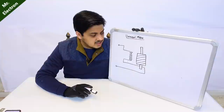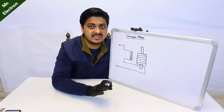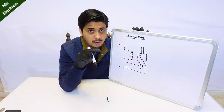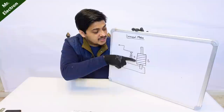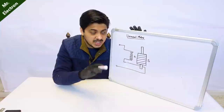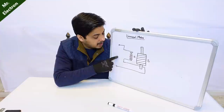That's the residual magnetism I was talking about. Because of previous operation, some residual magnetism is always left in motors, which is being utilized here. In this universal motor, this is the armature - let's assume that the motor was stopped at a point such that the poles stop with residual magnetism of north over here and south over here. Now when this rotor or armature is rotated at high RPM, that residual magnetism is going to induce EMF in the field winding, because of which some voltage is going to appear on the final two terminals, which is going to be very low.